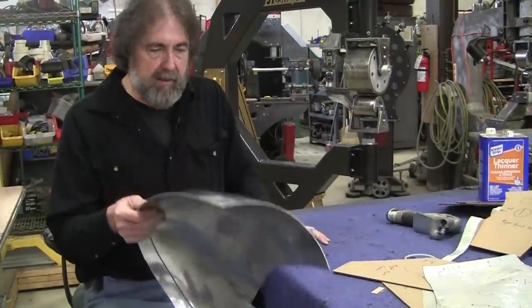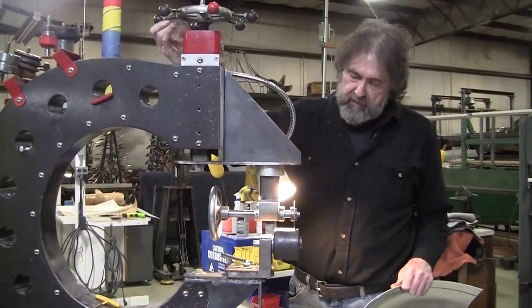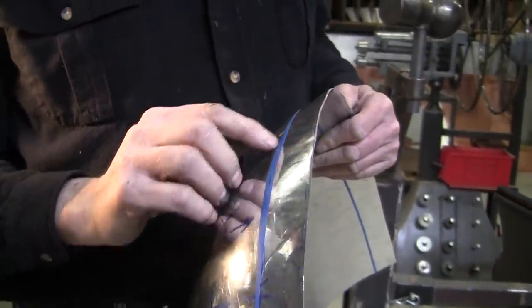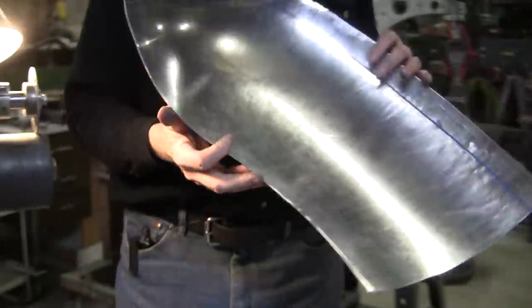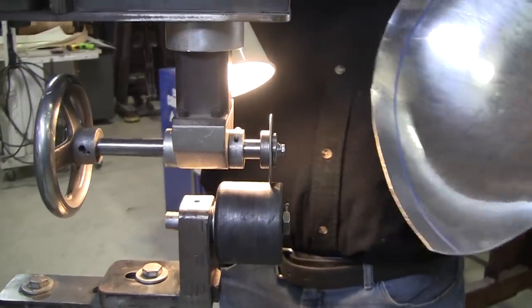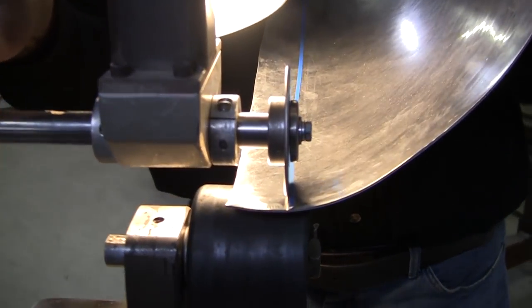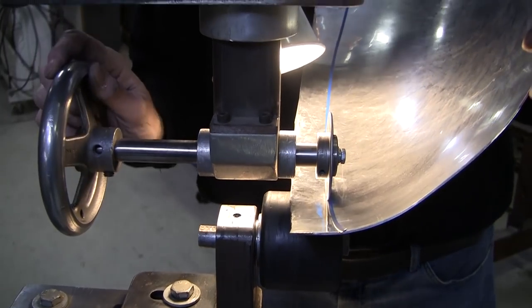Let's try tipping this and see what we get. We're going to do a preliminary tip — just really lightly touch it — and make sure our line is correct. I had to make an adjustment on the line right here because it was wandering. We want it to come on this side of that tape, so we're going to go in this way and just kiss these wheels together. You don't bite them in hard, just kissing.